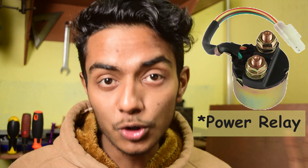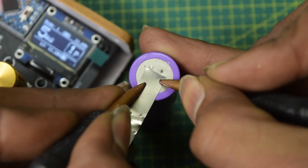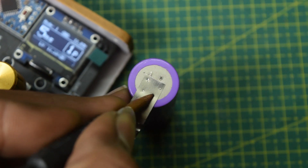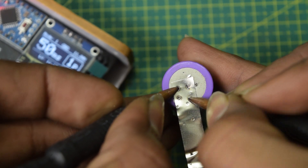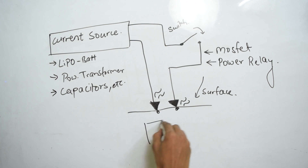These kinds of switches are not really going to work, so we need either a big automotive relay or a MOSFET bank. Now here comes another problem: if you manage to switch that high current, it is very difficult to manage the timing with a human hand. If the timing is too short, there won't be a sufficiently good weld, and if the pulse is too long, this can damage the battery — it can literally create a hole in your battery pack.